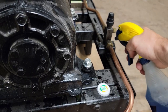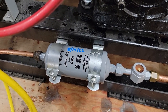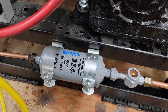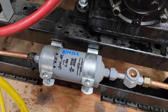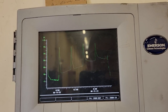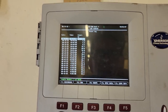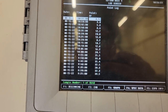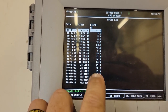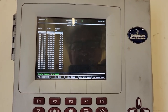A little more time now that we've got it running. Weighed in about an extra three pounds at first, and I found out my bottle is just about empty anyway, so we're just going to finish the bottle off in there — it'll be about 20 pounds. Hard to say if there was anything else. At this point, I'm going to scan the box one more time — with that being completely nothing in there, no hits at all when I was in there, I'm not too worried about it leaking. See how fast it dropped — about an hour and a half, 39 degrees down to there. We really started cranking down right about in there, then we had to shut it off to do some leak checking and stuff. Yep, she's doing good.